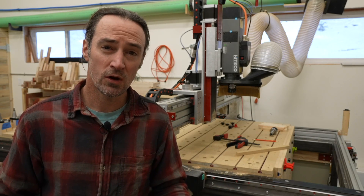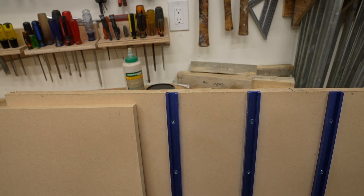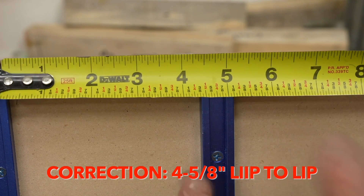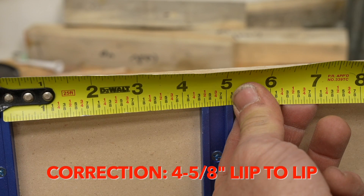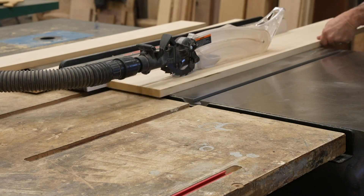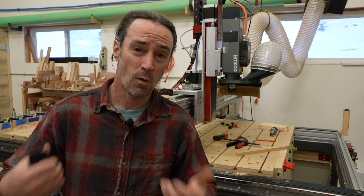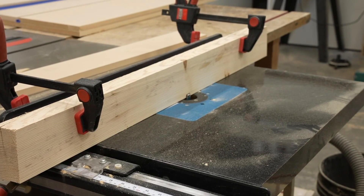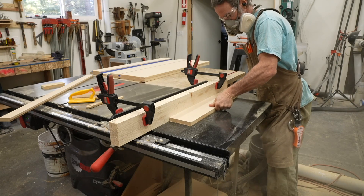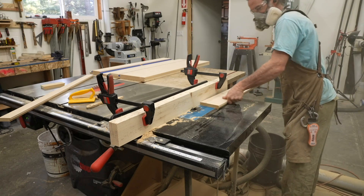The shallow T-track slots and pilot holes made it really easy to screw on the tracks. As I mentioned earlier, I like to have the top slats overlap the T-tracks to assist with hold-down power. I measured the distance between the two slats — for me that was five and one-eighth inches — and then ripped out all the slats on the table saw. Next I had to cut a rabbet so the slats would fit over the T-tracks. There are lots of ways to do this; I decided to use the router table and did a few test cuts until I found the right depth and width.